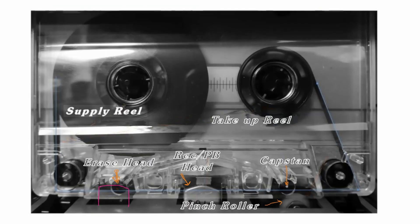Now we're going to look at the way the heads actually sit in a cassette. You can see the tape comes down from the supply reel, goes around a roller, over the erase head — which is turned on and off electrically — then over the record and playback head, then through between the capstan and the pinch roller, around the roller at the end, and up onto the take-up reel. This is the way a two-head single-capstan machine would look, and this is what most people have got.